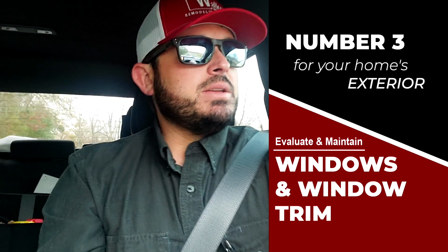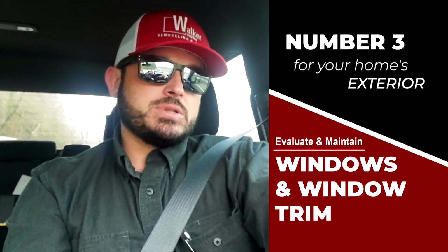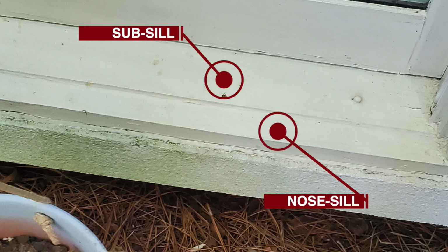Number three is going to be to take a look at your windows. Look at the window sills. The sub-sill is directly under the sash, and the nose sill is the front piece further out towards the home's exterior. If you notice any rot, or the start of rot, which will usually be some flaking paint, some caulking that's missing, and it'll start to feel light to the touch, address that.